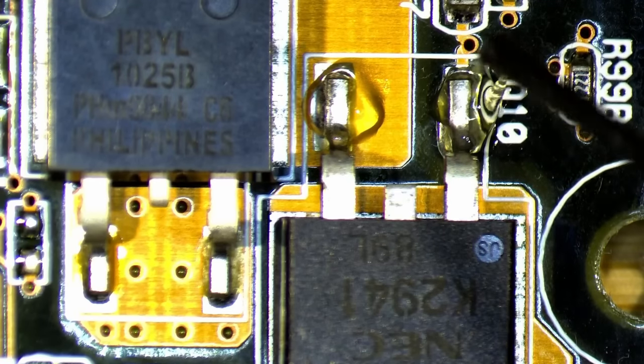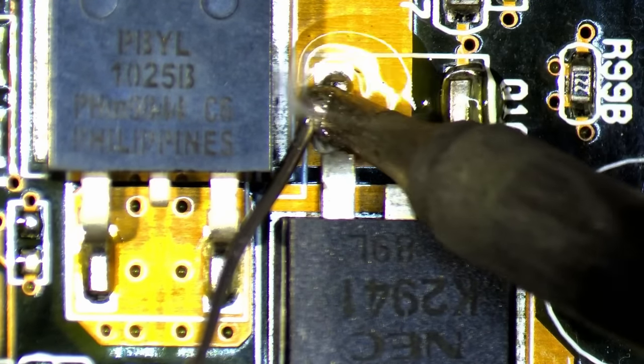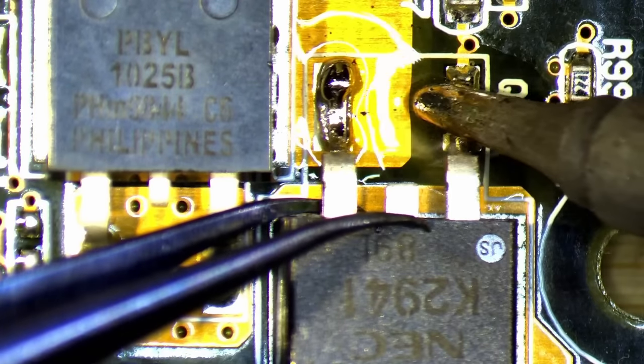By the way, I did remove the 3 capacitors right next to the transistor because they were too close to the large solder pad. Recapping those boards should be a priority anyway, so I see it as a slight head start.